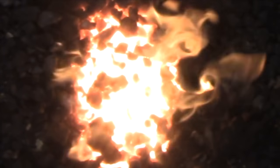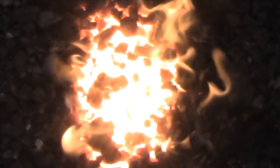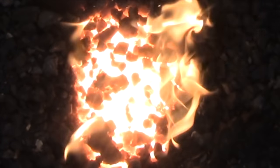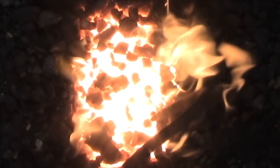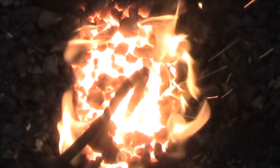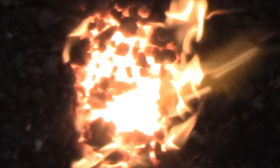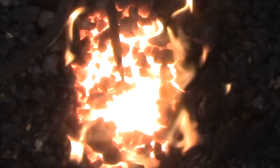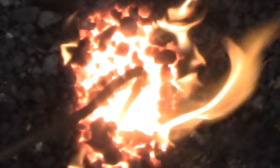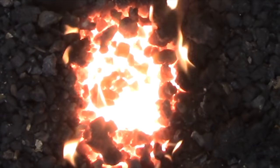The fire has been burning for a few minutes and I haven't touched it. It may look like it's doing well, but in a second you're going to see a dark line develop right in the center of the intense part of the fire. That dark line indicates that the bottom of the fire has just dropped out and it's actually burning hollow right now. I can confirm this by shoving the poker in the center of that spot — there are absolutely no coals there whatsoever. Poking the fire may seem to correct the problem, but all it's done is tumble some hot coals into that cavity, and as soon as they burn out the problem will return.